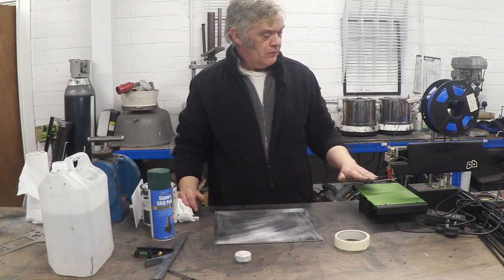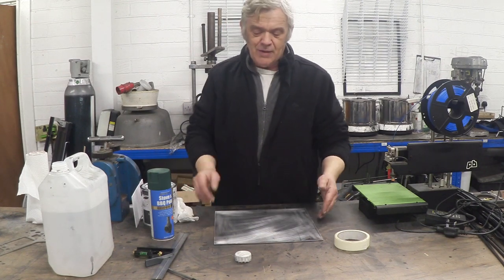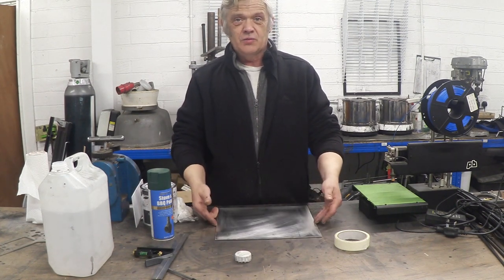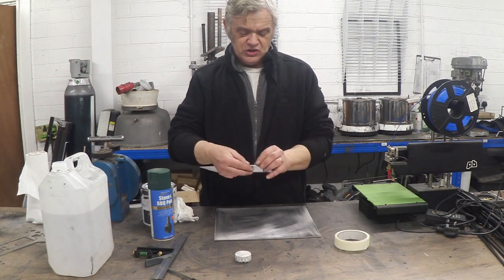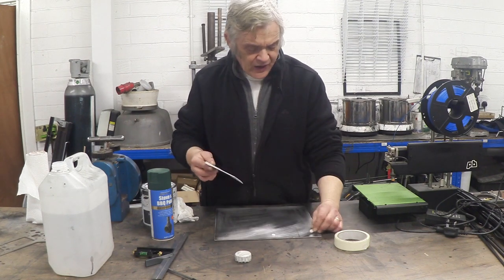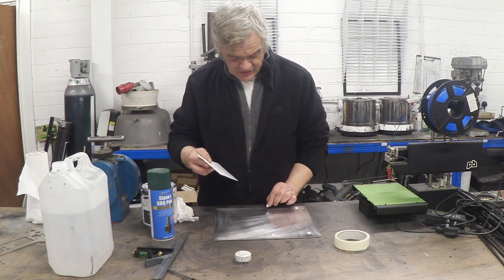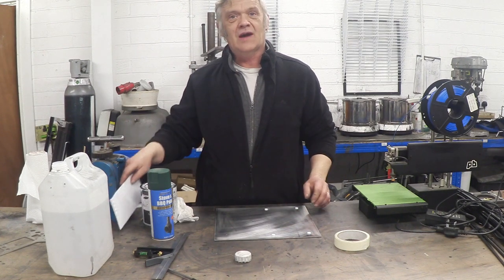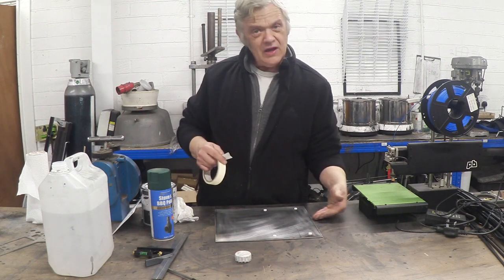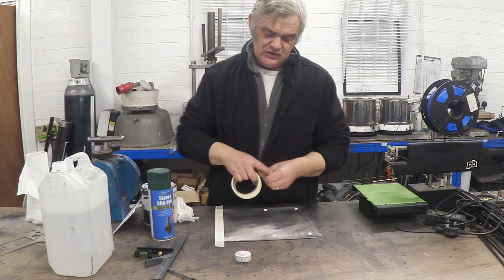After cleaning, avoid touching it — you now have a beautifully clean grease-free surface with a bit of tooth. We need to transfer the bolt marks from the original bed to the aluminium, so measure carefully. Remember it's going to fit face-down, so mirror the bolt positions. Cover those bolt positions with a little sticky dot to prevent paint going on them — I don't want the heater to come through at the bolt holes, so I can drill through them later without worrying about shorting out the heater. Then apply masking tape to wherever you want the painted area to extend to.